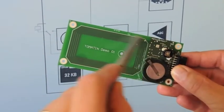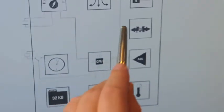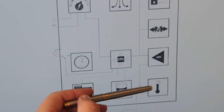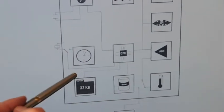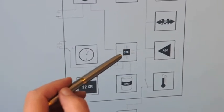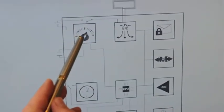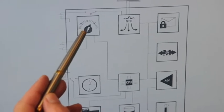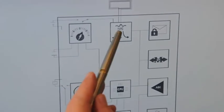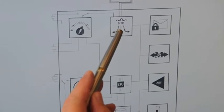The temperature data logger has a chip, antenna, and a battery. Inside the chip we have encryption, a digital interface, a 16-bit ADC, and the temperature sensor, and then a normal conventional CPU system. We have used the Texas Instruments MSP430, so you can actually make software today with standard components and then import it into the logger. We also have a battery management system, so as you saw, you can use it as an active or passive tag. The NFC implements the MIFARE standard and you can use ISO 14443 or ISO 15693 readers.